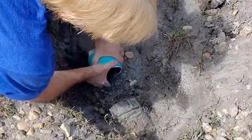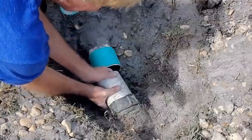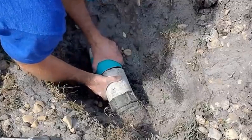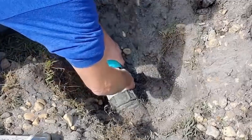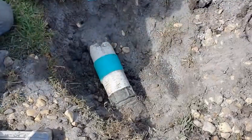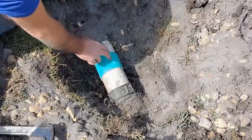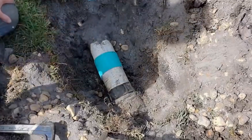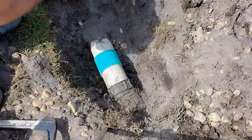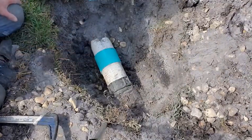You can see how I can slide it back, then take our piece and put it in. With a little bit of work — because it is tight — I can slide it over and make a perfect connection. This is the cheapest way to do it. I would prefer to use a slip coupling, but in a pinch, just cut the bell off your thin-wall PVC and you've made a slip coupling — piece of cake.